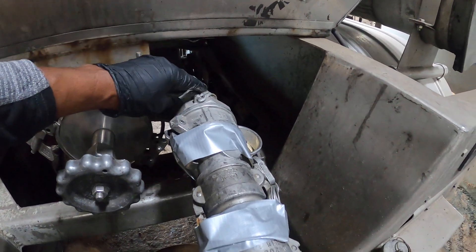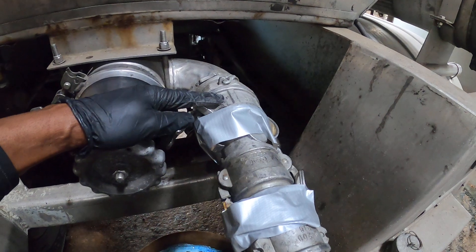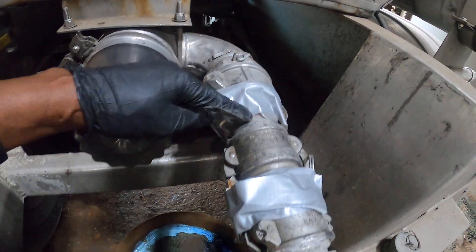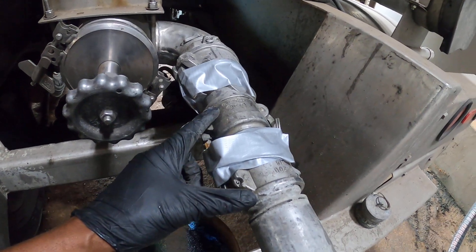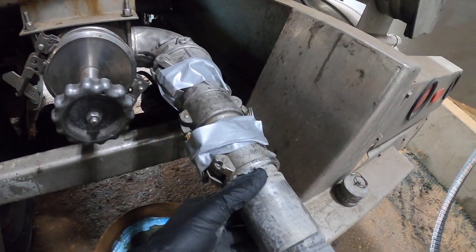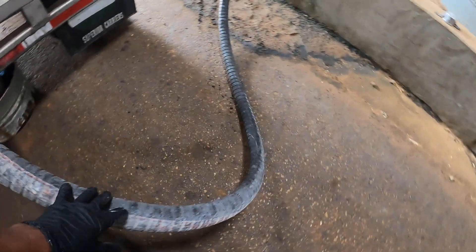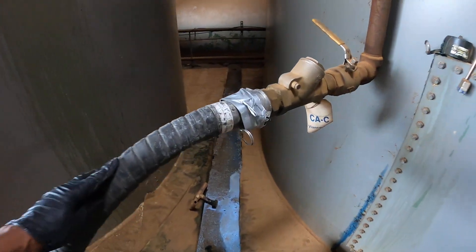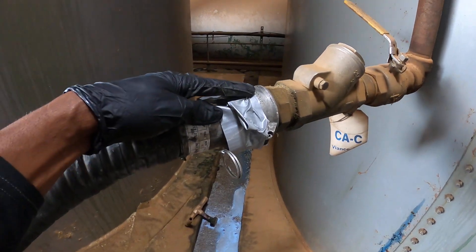This comes off of the three-inch outlet, then I have a female-to-male reducing fitting from three-inch to two-inch. Then I'm coming with a two-inch coupling to hook up my hose, which is a male connection, and it goes all the way down to the customer's female two-inch receiving inlet.